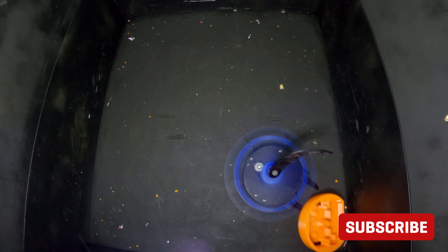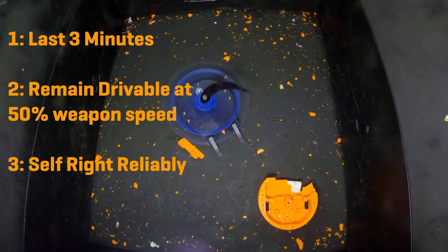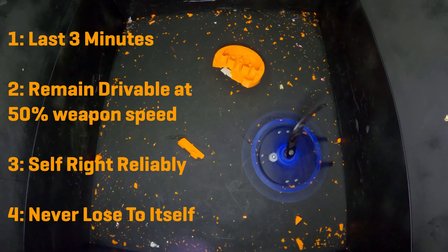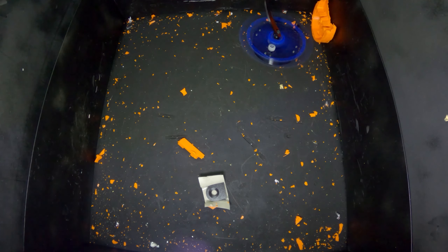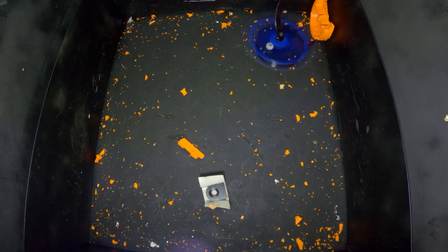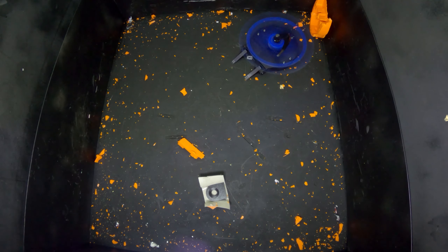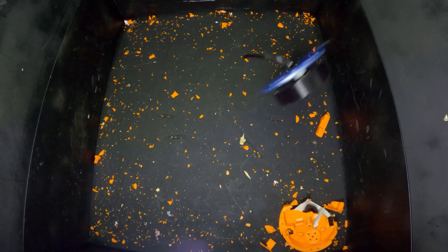I have, for all intensive purposes, completed this quest. To recap, my goals for Mini Mulcher were: 1. Last 3 minutes. 2. Remain drivable at 50% weapon speed. 3. Self-right reliably. 4. Never lose to itself. I had completed the first of these goals months ago — I've only ever used the same 300mAh 3S battery, which allows a constant current draw of an average of 6 amps for the 3-minute match. The power demands increase exponentially with weapon speed, because air resistance increases with the square of speed. The motor I'm using can peak at 22.5 amps on startup, but as you can see from my last video, I can easily run it at 50% speed for more than 6 minutes before running out of battery.